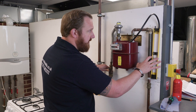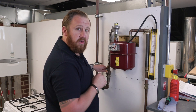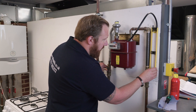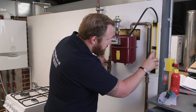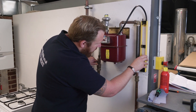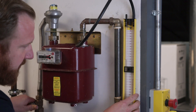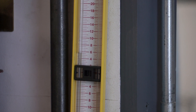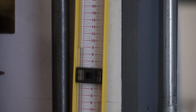Some valves are quite stiff and there won't be much movement; some are quite loose — it's getting a feel for it. On this particular gauge it's millibar on both sides. If it's got a split scale — millibar and inches water gauge — make sure you're reading the correct side. We're going to slowly open our emergency control valve, nice and slowly, and watch the gauge starting to move. We're looking for between 7 and 10 millibar. We're at 8 millibar — let's slowly shut it. Don't slam it shut or it'll spin round and throw water over the top of the gauge.